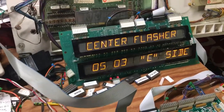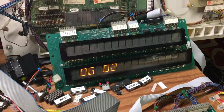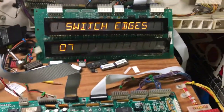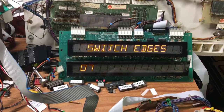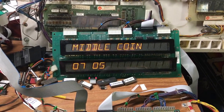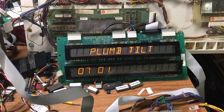Next test is switch levels. It's going to tell me switches eleven and twelve are closed, and switch two was closed because the C side on Black Knight 2000 requires switch two to be seen as closed — that's an opto coupler on the interface board. Here's everything in column one, and here's everything in row one.